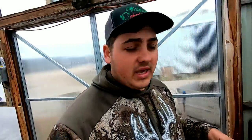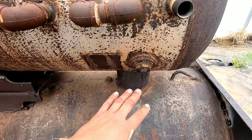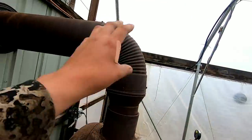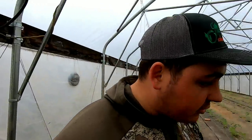With wood stoves, the more surface area you have, the more heat is going to radiate out into that particular area. So we load up the wood in there, it burns nice and hot, and the smoke comes up through here into this old 60-gallon air tank. Then the smoke continues on and goes out there. This is where it gets exciting — you guys see all these bars here. Come to this side right here, this is where the excitement happens. What we did is we tried making our own style of geothermal heating — it's radiant heat. There are a few videos on YouTube where some guy in Nebraska is growing oranges all winter long, but here we're just growing tomatoes. So I'm going to explain our system.